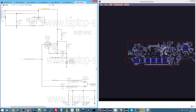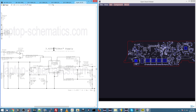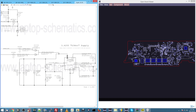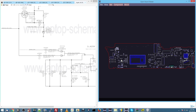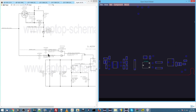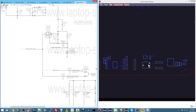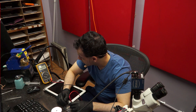I have 16 volts on DCN — I just measured that. Now I want to see where the 3.42 volt power supply is. So this is input — 18 volts going through here going to VIN, which stands for voltage in. So let's see what I have on D7005. I'm just going to check at some random points. I want to see what's coming from the charger through R7005 on pin 2, and I have 16 volts coming in there.